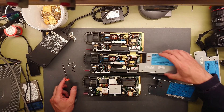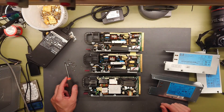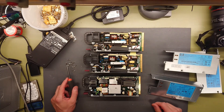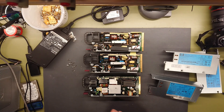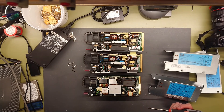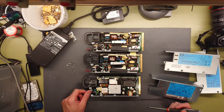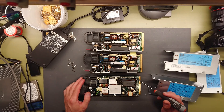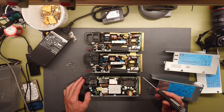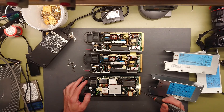Looking at the connectors, it's the same interface and the markings are the same, so I think grounding the same pins will actually boot up all three power supplies. Making these float, there are a few things you have to do: disconnect the ground from the mains input and the negative rail on the output. That includes a connector from here down to the chassis, which is underneath this little connector board.